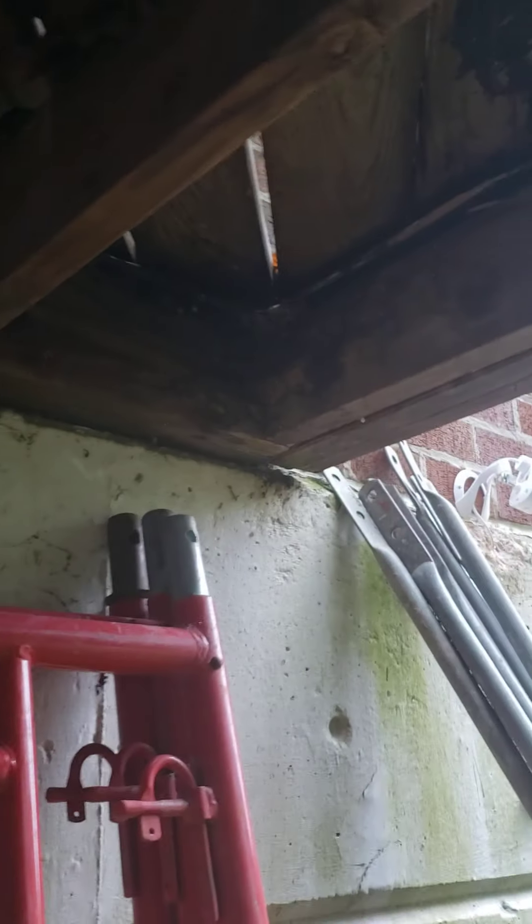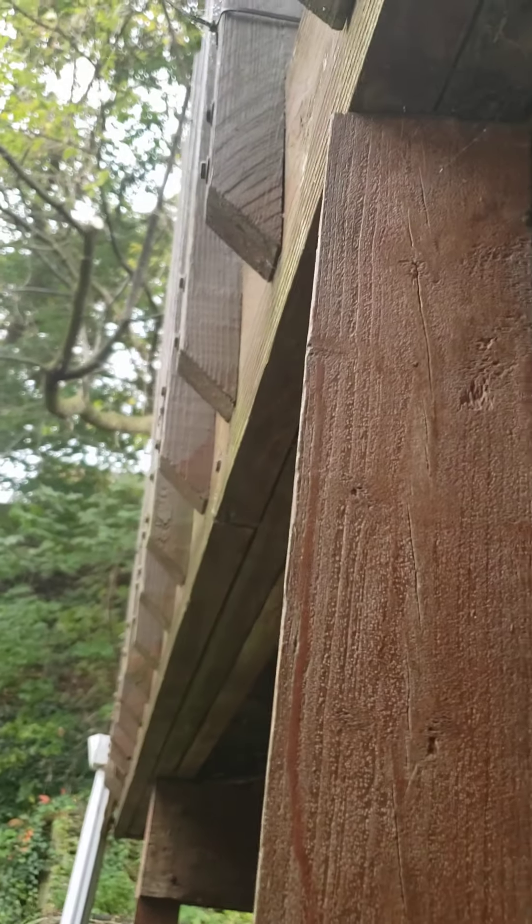They're not even sitting on the joist there - they're being carried on this one. I've got a really good idea now what's going on. I didn't understand when you were telling me - I thought it was under here. I was told it was built over something, and it does look like that. At least they're sitting on this back ledger - the foundation itself is sturdy. But these pieces - this post is sitting kind of cattywampus.